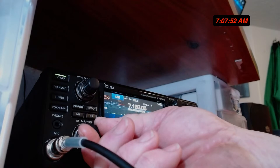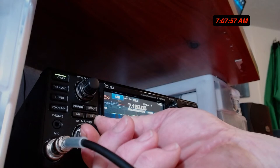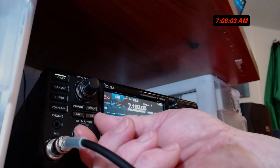This could very well happen, and the reason for it is there are other hams whose signals come in, who normally we couldn't hear and they couldn't hear us, because of Grayline. That's one of the things Grayline does. All of a sudden it'll appear, wait a minute, we were on frequency, where's that signal coming from? That's Grayline.